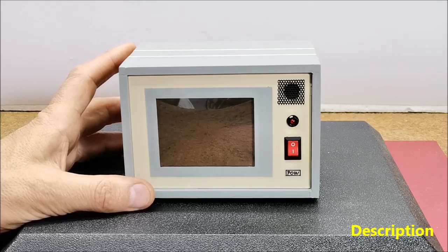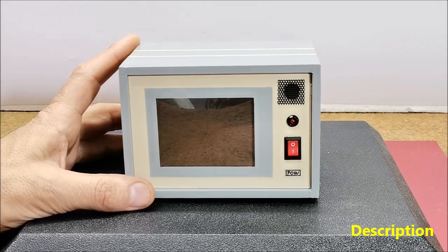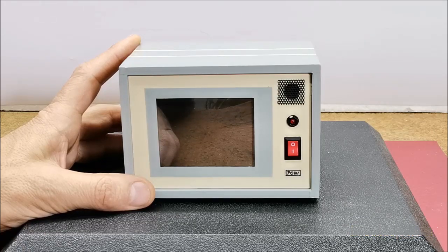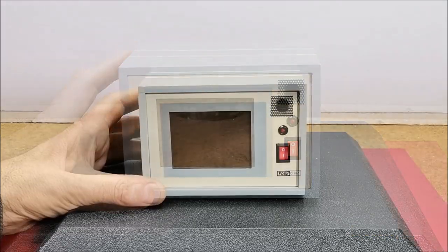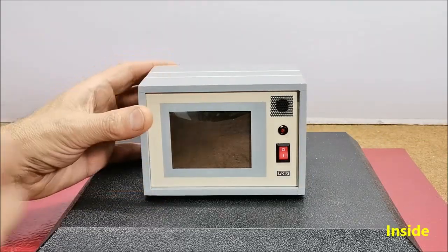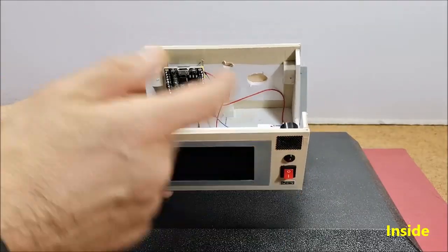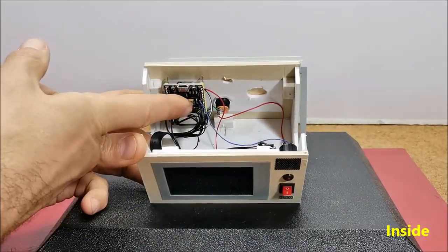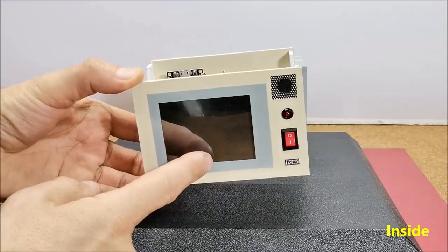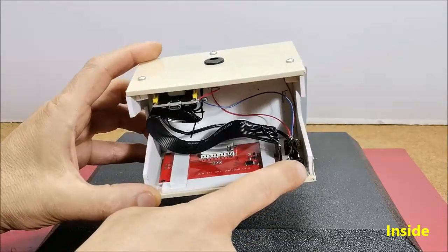You can find the original project on YarnWiz GitHub and I slightly modified the code by adding some sounds that made the game even more interesting and realistic. The device is extremely simple to build and contains only three components: an ESP32 DevKit microcontroller board, a 2.8 inch TFT touch display, and a buzzer.